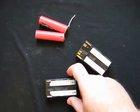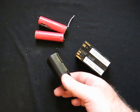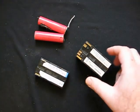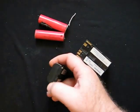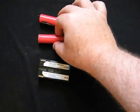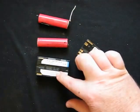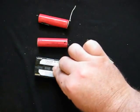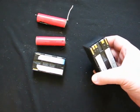I like to use these Li-Ion batteries — a standard generic Canon BP911 or BP915 battery; they're both the same. These are generic ones bought from China and they work really, really well. They contain their own battery protection circuit inside, plus two cells, which combined give you 7.4 volts, and typically a pack of that size will give you 2 amps. You can link these together in parallel to get more amperage. Another example has four cells inside, but it's the same principle.